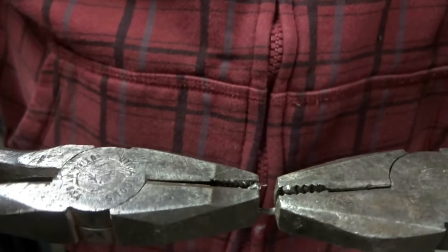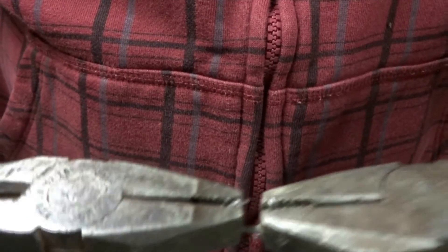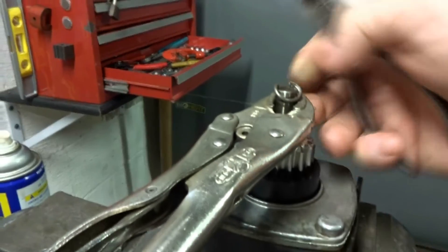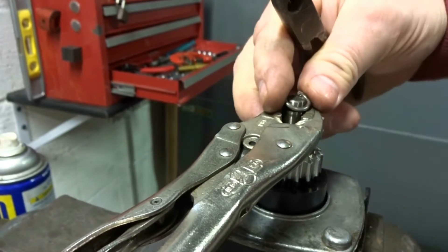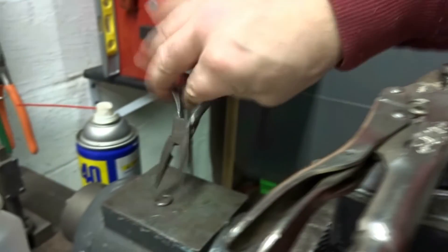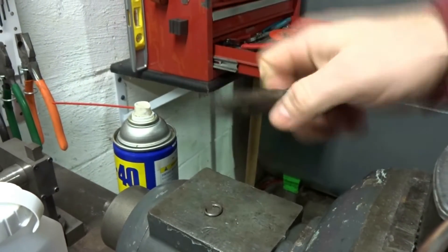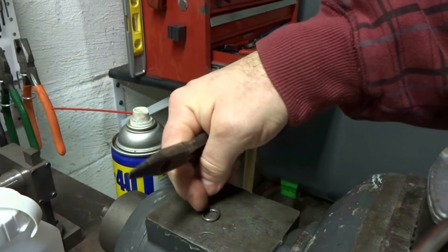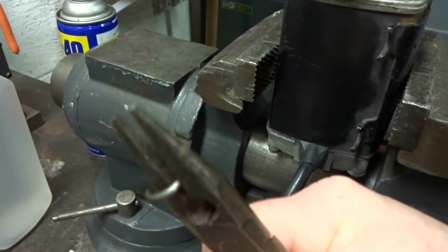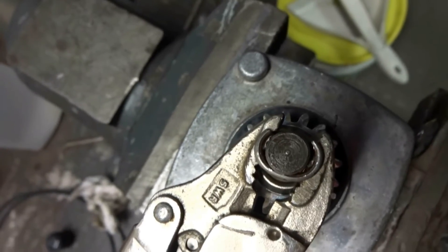To bend the retaining ring back — it's slightly off — just take two pairs of pliers and give it a little nudge. You can see now that it's straight. This ring will not fit back over after you straighten it, so take a pair of needle nose pliers and squeeze it at the bottom to flatten it out and spread that split spot open, and just give it a little squeeze until you flatten it and make it open.